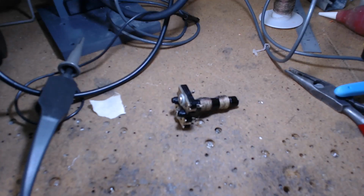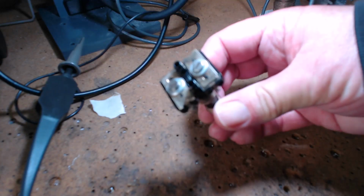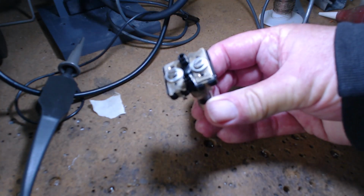I woke up this morning only to find a comment from someone about my IF can. It's not going to work. It has to be set for 1,000 kilohertz. I did mention I use Professor Coil. Each coil has a 150 picofarad cap across it.